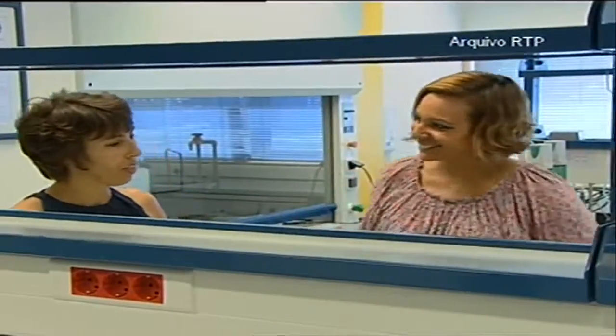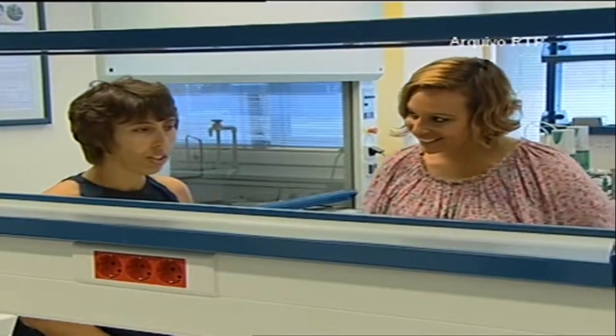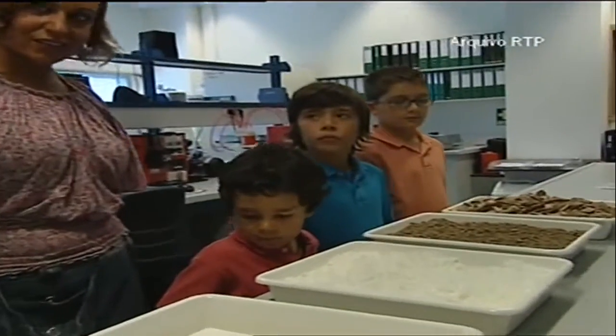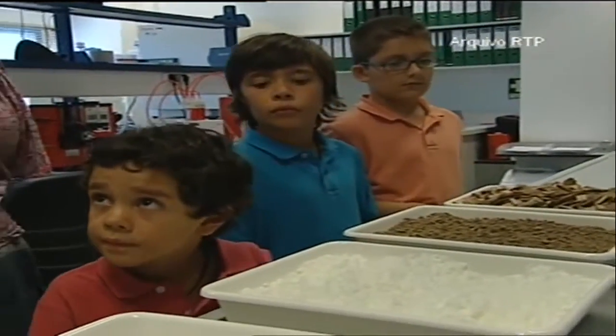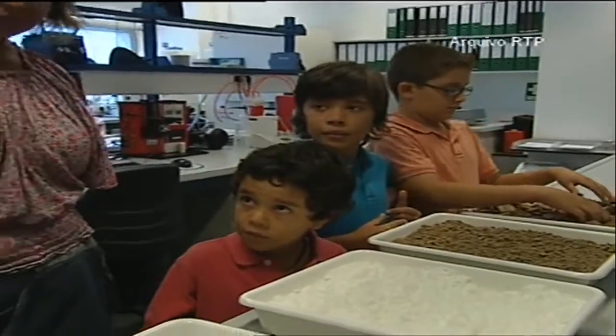Hello, I'm Cidália Breu. I know you've been to Espira's homestead planting eucalyptus, but now we'll see what happens to the eucalyptus when they reach the factory. When they reach the factory, the eucalyptus are peeled and cut into tiny bits called chips. Those chips are then put into a piece of equipment called a digester, a kind of gigantic pressure cooker, where they're cooked at high temperatures with chemical products. Those chemical products are then saved and reused.